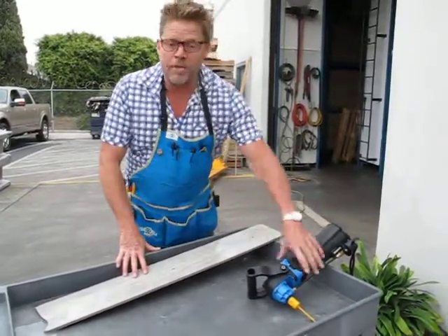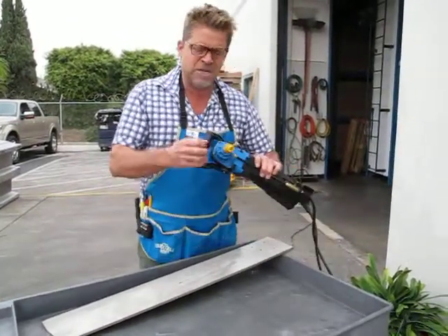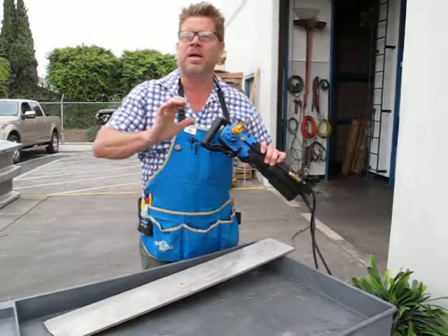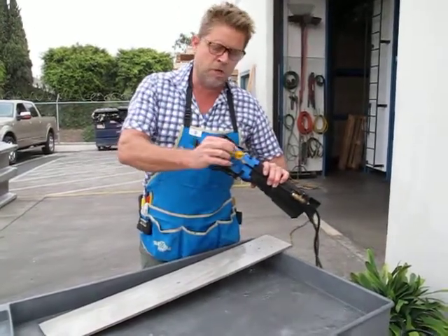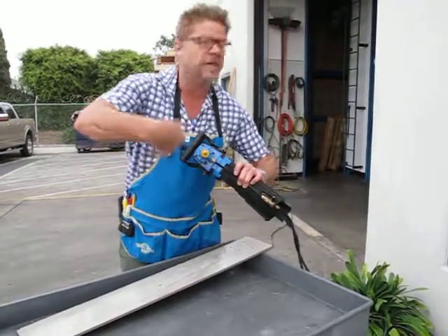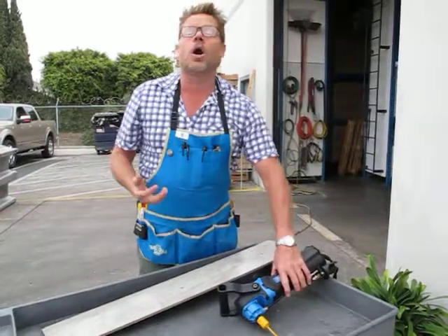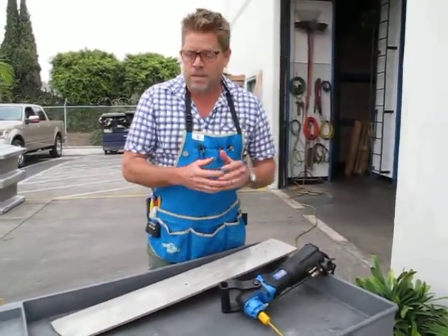If you're trying to run this dry on just a regular grinder running at 13,000 RPMs, it's just gonna heat up. If you did it in the dark, it would glow bright orange. I've literally seen guys where they melt and twist them, and then they come to us saying it's no good — it's good, you just have to run it the right way.